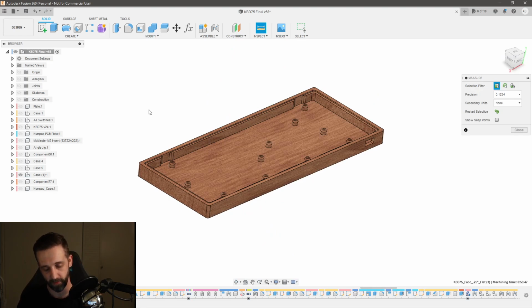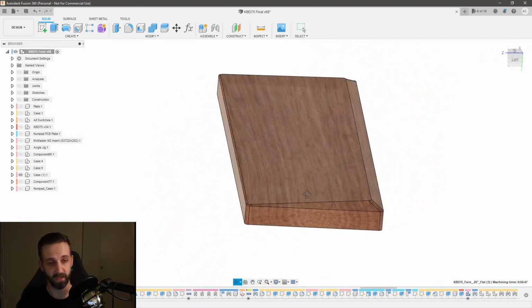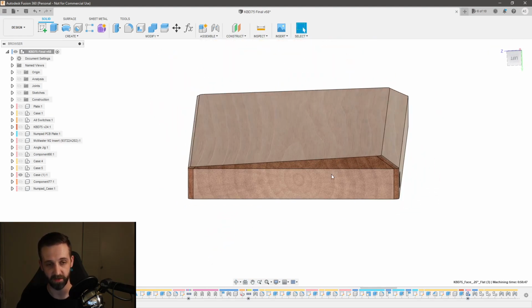So that presented a big problem because now I didn't have the correct alignment, right? My dowel pins were cut off. So if I would have caught that ahead of time, I could have kept it on the CNC, kept my alignment, and gotten a perfect result. But what I ended up having to do, which was infuriating, is the only way I could machine that is from this orientation, right? So I had to machine it from this side with no tabs or anything, and I had to hold on to the part somehow.